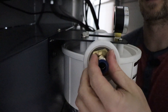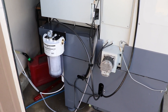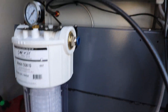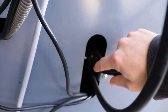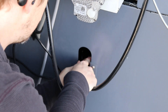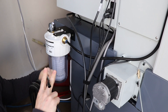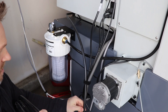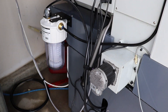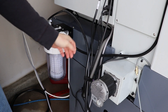I've got these all tightened down already. Now that that's mounted, I can put the tubing in. The Tormach's cooling has a couple of options for lines — they come from the pump and into this splitter. I'll disconnect this one that goes up; it'll probably leak some coolant out, but that's all right. I wasn't able to find the exact same stuff that Tormach uses, but I've got this nylon tubing I got off Amazon, so I'll just use that for the short little run.